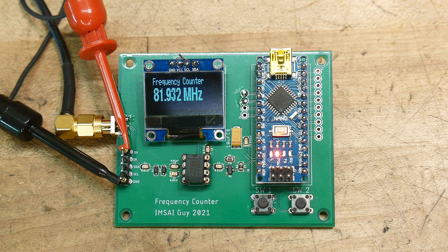Let's try three megahertz — nope. Seven megahertz — now I thought we did five megahertz... 10 megahertz, okay. There's something weird going on here. 50 megahertz — oh, I had the amplitude set too low, sorry. There we go. 50 megahertz okay, let's go to 10 megahertz — that's fine. Five megahertz — yeah, I just didn't have the signal level set high enough. Three megahertz — yeah, three megahertz works, so it'll cover most HF stuff up to two meters. I'm not sure about 440 or not.